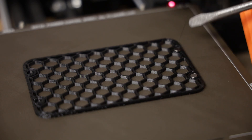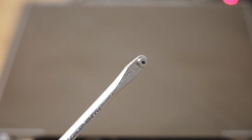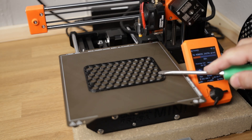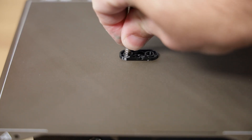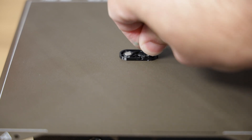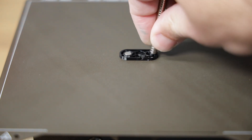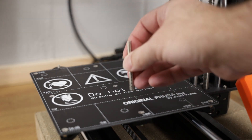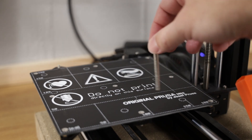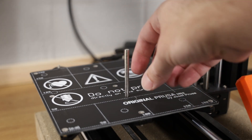Step number six: when the printer pauses, move as quickly as possible to put the magnets in the holes and resume printing. I like using this very old flathead screwdriver that hasn't been used to fasten a screw in over a decade. This way I can get to the magnet hole from the side of the print as opposed to from the top. I find this method easier than using a stack of magnets, since getting the bottom magnet free from a whole stack can be a little bit hard with these super strong magnets, and I don't want to risk knocking the print off the bed. A quick side note: the print bed on your 3D printer is probably magnetized if you have a newer printer. If you position the model in a way that the magnet hole will be directly above the print bed magnet, you might have issues with the polarity interfering. So make sure you look around for where the magnet on the print bed is before you place the model on the bed.